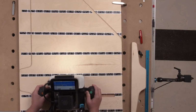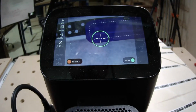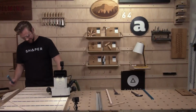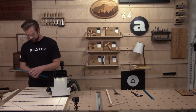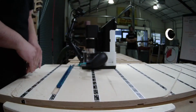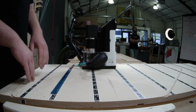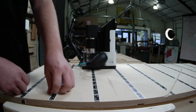And since we're taking away 0.01 plus 0.004, 0.014 inches of offset, it's going to be a really smooth cut. So no jerking around, and you're going to get a really nice wall finish. Yeah. Really nice edge quality on that. And just what I was looking for. Yeah, that's good. Friction fit. Again, I did do this prior, so I know that 0.004 is going to fit really well. Because I'm relying on a little bit of friction, but mostly these screws to hold this track down. But friction never hurts.